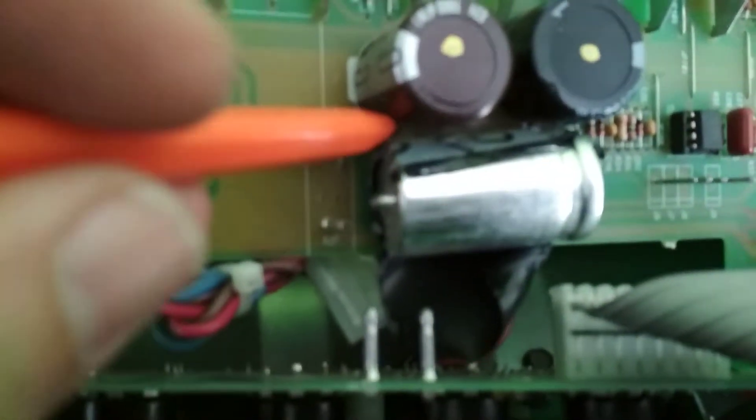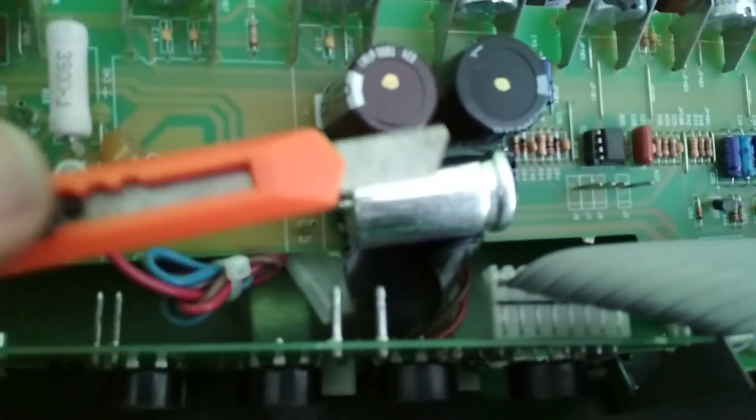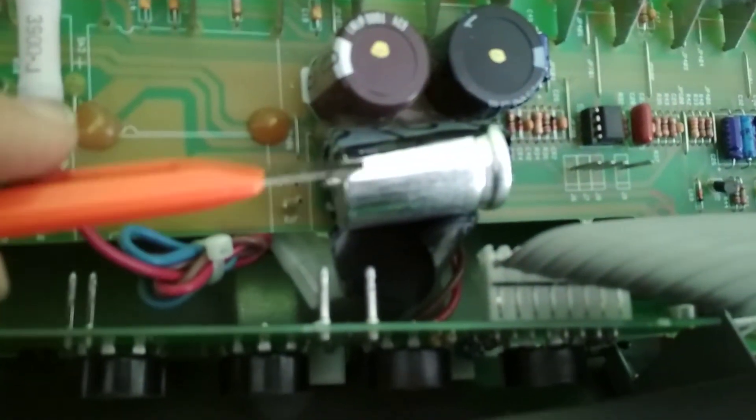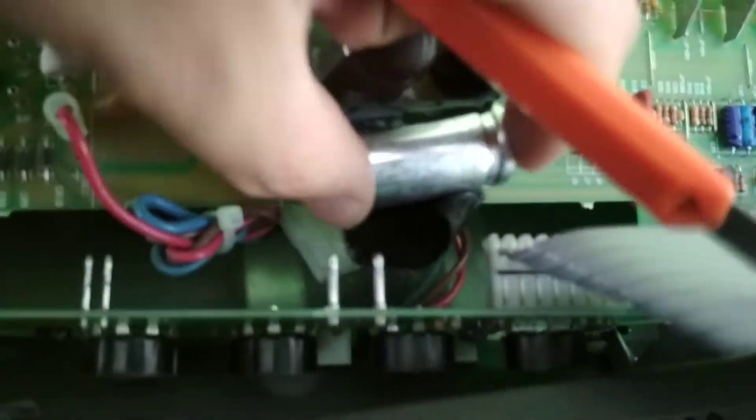If a capacitor is glued to death — and they do love their glue, there's about half a gallon in here — get a sharp knife. Careful you don't cut yourself, and run it along the plastic cover of the capacitor. Then you can pull the capacitor out safely. That's what they look like without the plastic on it. Then you can just peel it off the glue, take the pins off, and eventually you'll get a working amplifier.